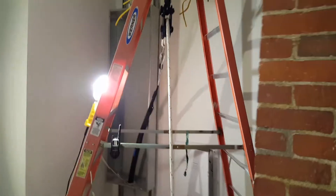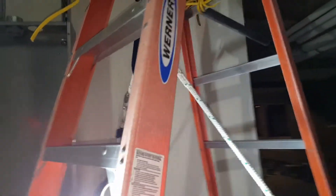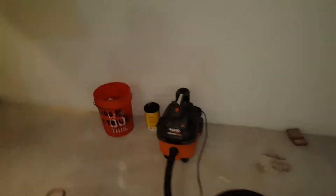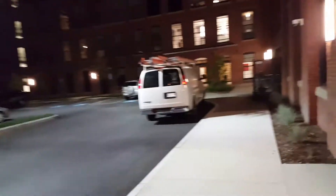Pulling this 300 aluminum right through this winch setup. It's a 400 amp main breaker panel. Snatch block. You're going to pull one more set, all the way to the main switchgear on the other side. It's about 250 feet.